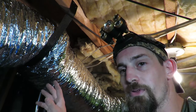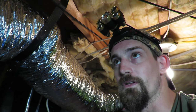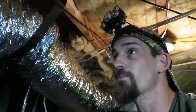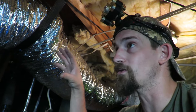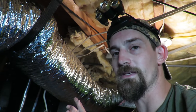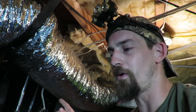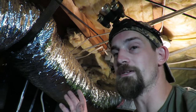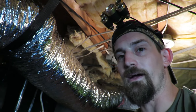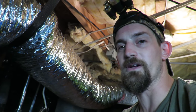The job on this piece is pretty much complete - still got to do all the other ductwork, but this one is finished. It takes about 15 minutes to do one duct work piece. Make sure you don't let it sag too much and don't crimp any of your piping or have any really sharp corners. There are a couple different sizes in here - I have some that are six inch and I think one is a four inch pipe. Make sure you put on the right size in the right section; you don't want something too big because it could cause blow-by at the end.